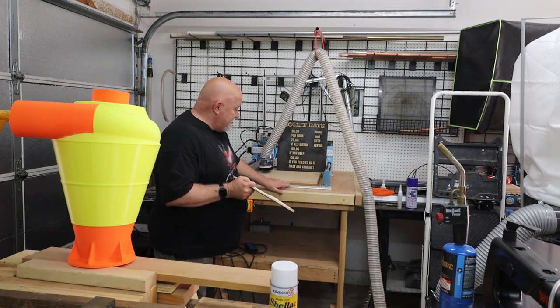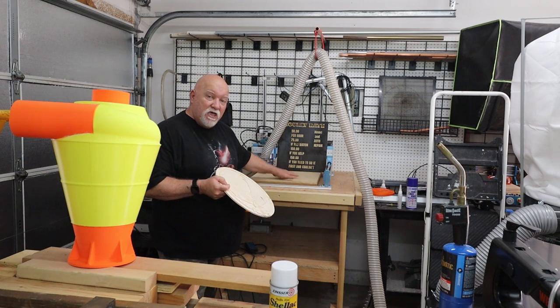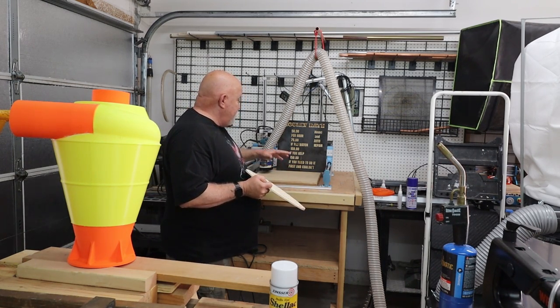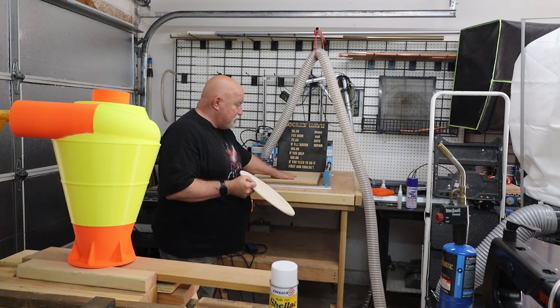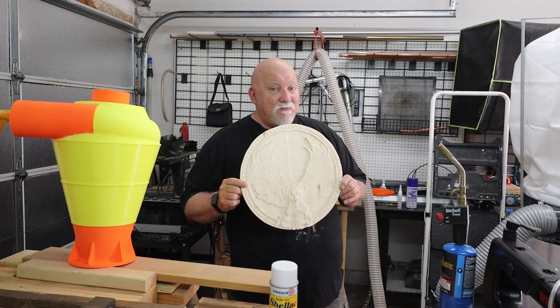There's no reason for me to damage the one that comes with the machine when I can put a thin piece of material on top of it, which will work perfect. So that's what I'm using for a waste board. So all my future work, I simply tape it down. For now anyway, I don't know if I'll ever go with clamps again, but I use a blue tape method and tape everything down. But as far as this sign, it came out good.